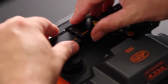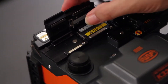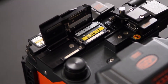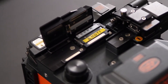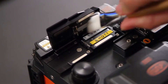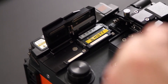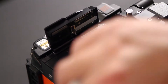The first component is the stripper. Make sure that both top and bottom blades are free of any debris. Utilizing your soft bristle brush, just sweep away anything that has built up on the blade. If necessary, use your tweezers to pull out any debris.